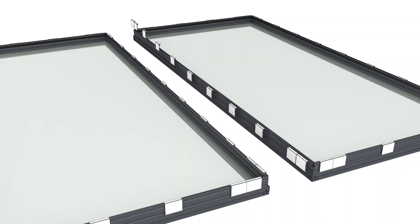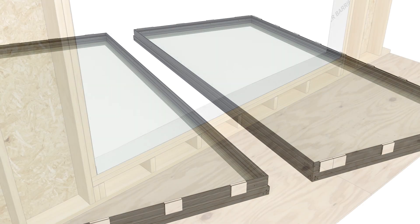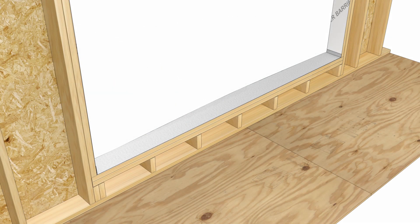Your frames are usually prepped from the factory. All shim blocks along the mull are removed, as well as the blocks at the top and bottom that will interfere with mulling later. Establish an exterior plane along the sill for reference. This is especially helpful on wider assemblies.